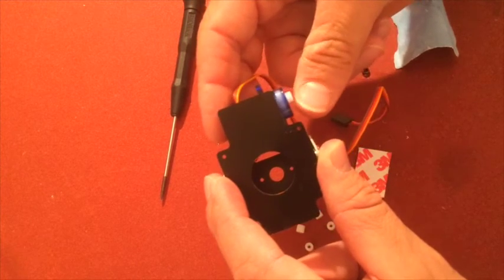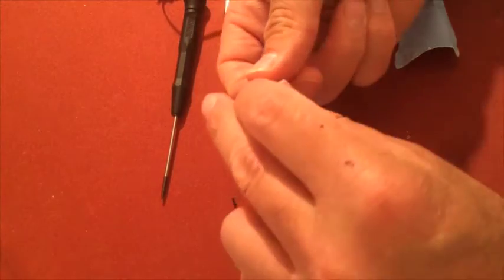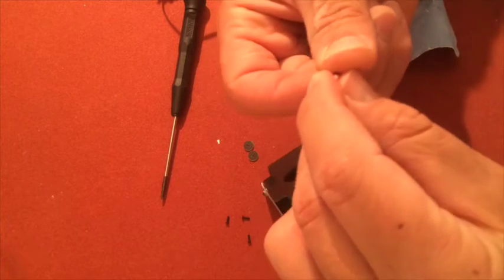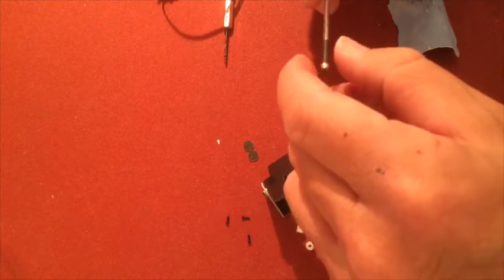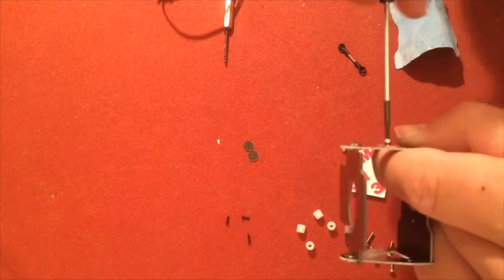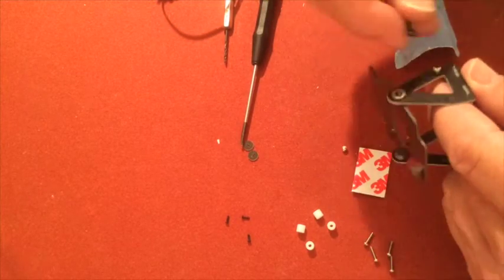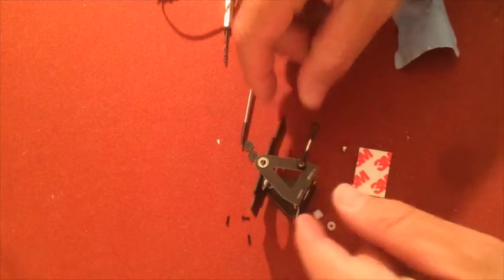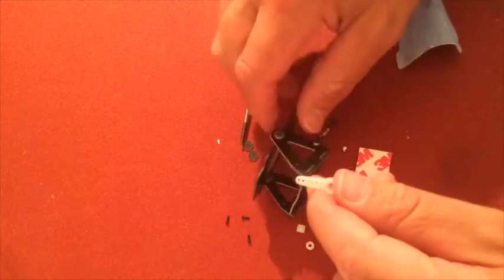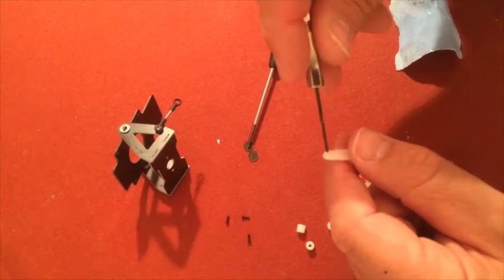So the important thing here is now to get the servo the right distance. So first we will mount a little thingamajig here. It has a little flat area right there, so now here comes. Like so. And we click that on there. Now we take the servo arm here, and these holes are too small to let the screw through, so I will take my little drill.